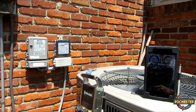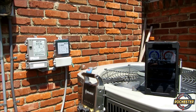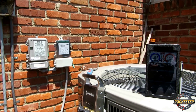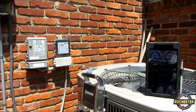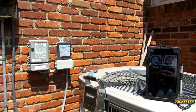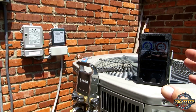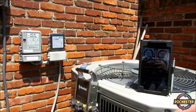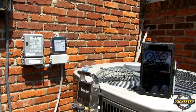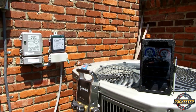That's what's so fantastic about the I-Manifold. While I was down there, I actually tested with our PRH2. I got our wet bulb and dry bulb for our supply, and our wet bulb and dry bulb for our return. So we've got airflow, wet bulb and dry bulb on both the supply and return. We came out back here and I actually put it into the user inputs — I put in 1007 for our CFM — and it asked for nominal tonnage. I put in 2.5, then I entered my wet bulbs and dry bulbs and all that good stuff.